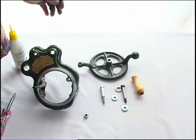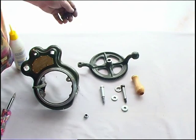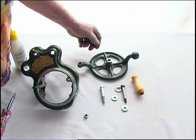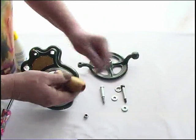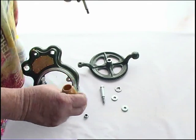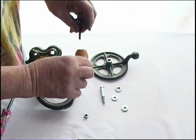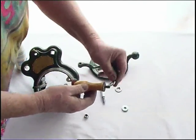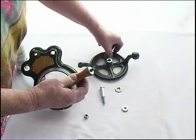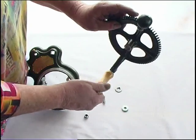Our base is now assembled, and we'll put the wooden handle on the crank handle and put the shaft and the various washers into the crank handle. We've got this new modified crank handle. We take the shaft and put it through the middle of the crank handle, then put a washer onto the end of it, and it screws onto the crank.